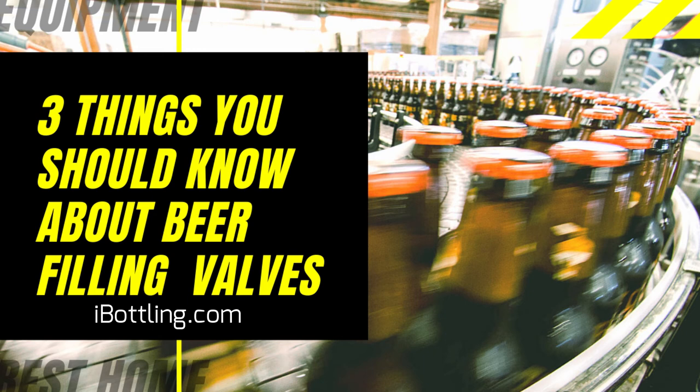Filling machine troubleshooting methods. There are two main ways to check the fault of the filling machine. Method A — Intuitive Method: maintenance personnel can often reduce the fault to a certain part by observing abnormal phenomena such as light, sound, and smell when the fault occurs. Method B — Self-Diagnosis Function Method: although not reaching a high degree of intelligence, the filler has a strong self-diagnosis function. It can track the working condition of the mechanical and electrical parts at any time. Once an abnormality alarm occurs, the approximate cause will show up on the panel, so we can find the approximate location of the fault.